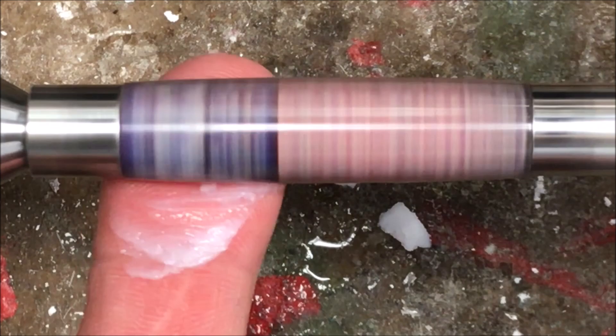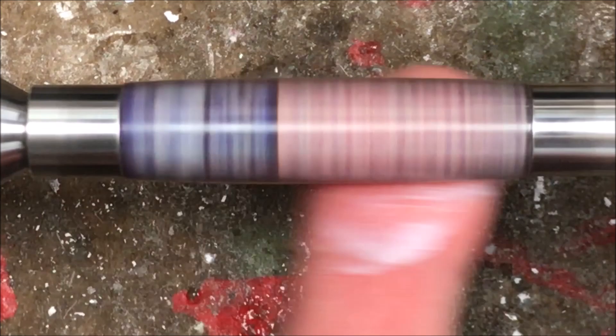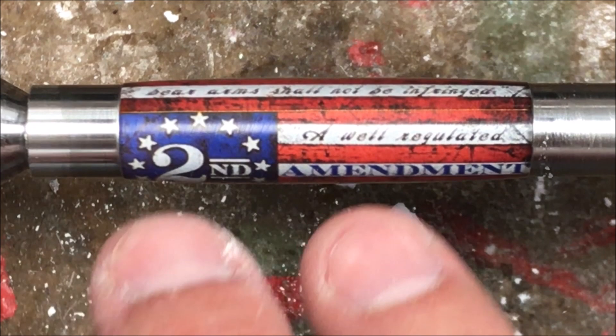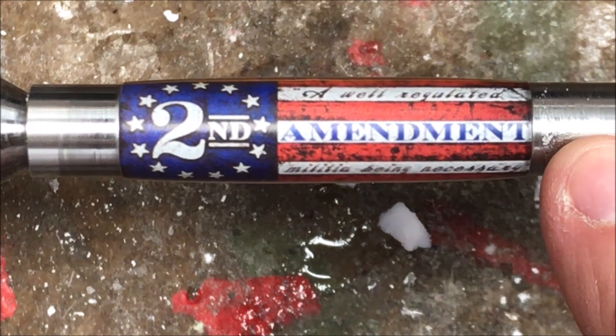You can feel it — right now I'm feeling a little bit of drag on my finger, and now the whole blank is waxed. Just continue to move your finger; it might get a little bit warm but it doesn't get hot. I'm running at about 1,100 to 1,150 RPMs. When you feel it sort of tug on your skin, you know the wax is done and it's time to buff it. Let's get this off the lathe, put it on a mandrel, and buff this blank up.